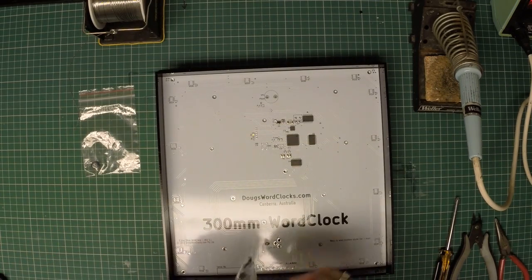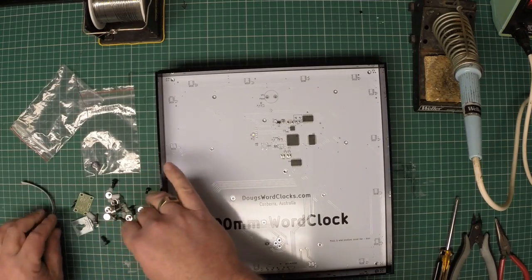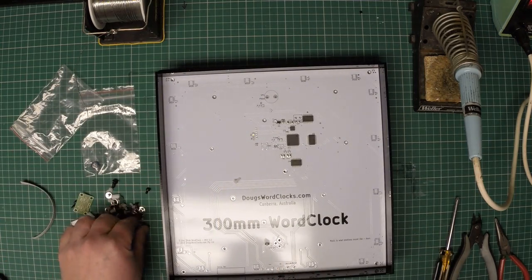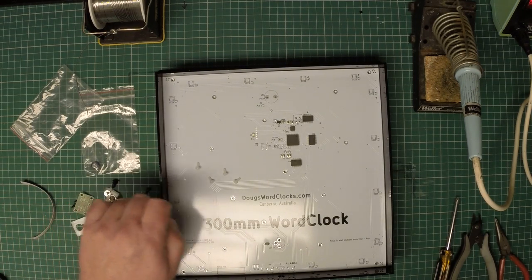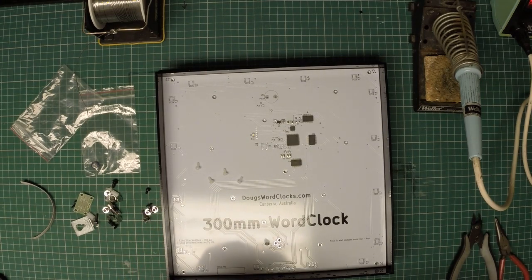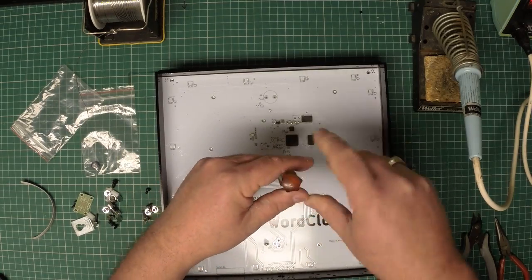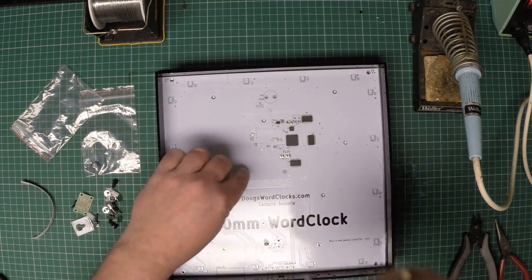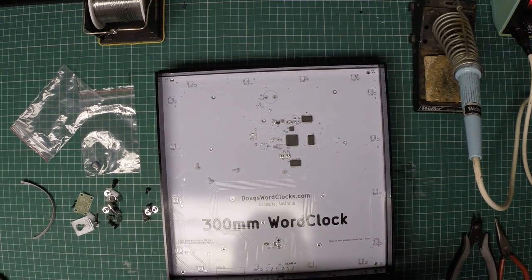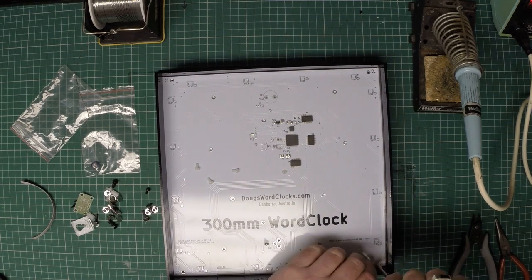Now we're ready to mount the circuit board. Inside our little hardware kit you'll find a whole pile of goodies. You'll find 7 of these tiny little white nylon screws. We only need 5 for this step. Grab a screwdriver. The holes in the mount are pre-threaded for you, so it's just a case of gently screwing the 5 mounting screws in place.